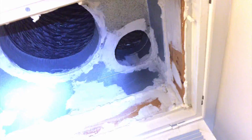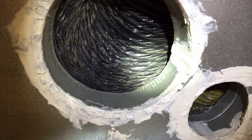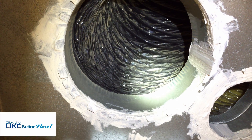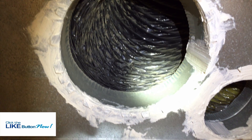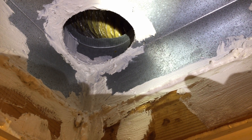Here is the finished product. I duck buttered the fire out of this thing. Here you can see the major penetrations — I sealed with spray foam and then used the duck butter on the thinner gaps, even over the spray foam. Right there, believe it or not, there was a lot of gaps, which connected to the attic, so it was probably pulling air out of the attic. You can see the dust and everything in that air duct — that's the main trunk line. This is how to seal the cold air return better, just to get you some better airflow through the filter, which will improve your indoor air quality.